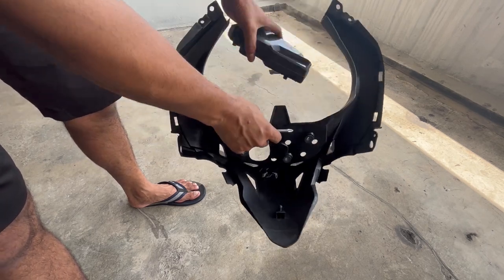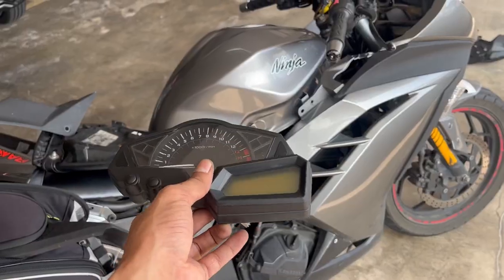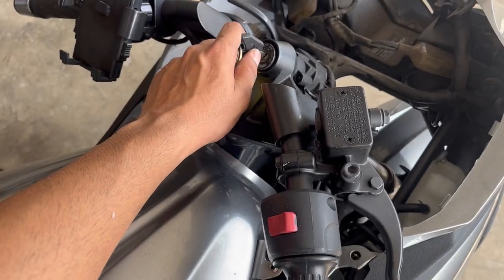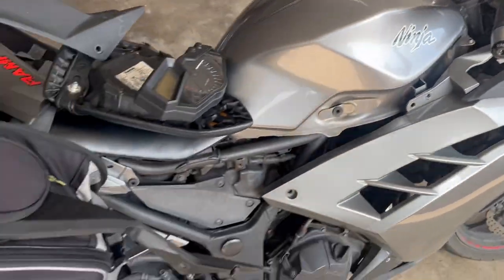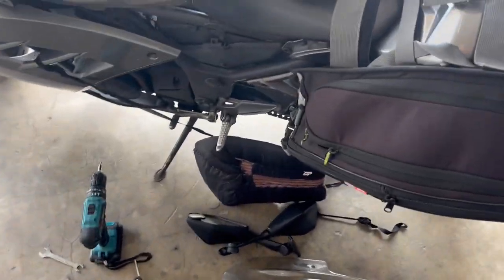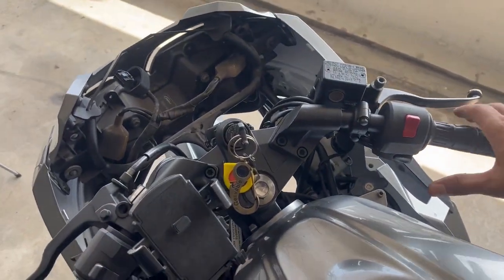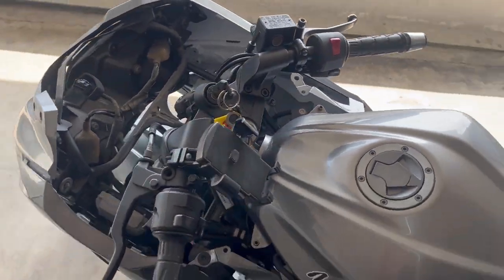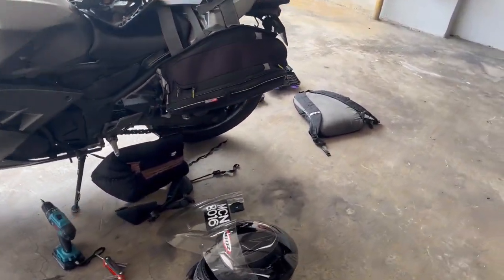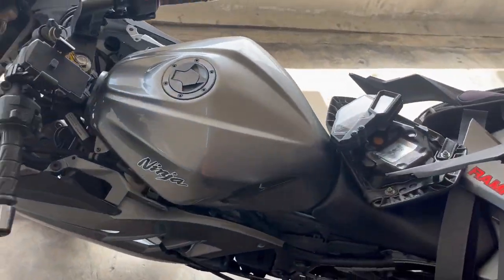Out it comes - we have the meter now, we can go and fix it. With the meter out, let's see if the bike can start without the meter. I turn it on - oh yeah, the fuel pump sound is there. The bike should be in neutral... let's do it - oh it does actually start! Nice, huh. The bike is all torn apart. Okay, let's close it up and take that meter to fix it.